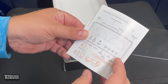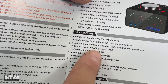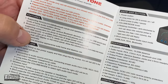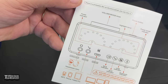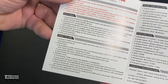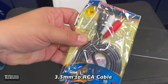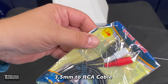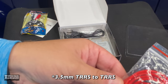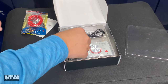We have a shield. Here we have the owner's manual. According to this, it says 50 watts by two, but I'm pretty sure this is a TPA3116 chip — that's the theoretical maximum of that particular chip. I can't wait to see the VU meters. You can use it with MP3, phone, tablet, laptop, computer, whatever you want. They also give you a 3.5mm to RCA adapter. It's always useful — 1.5 meters.